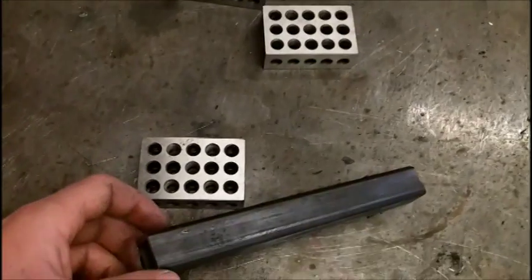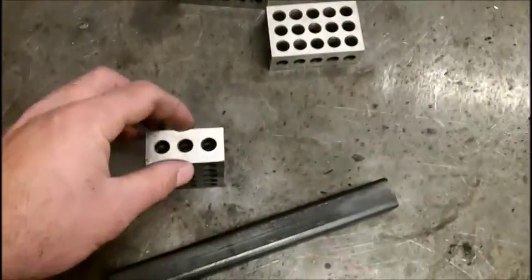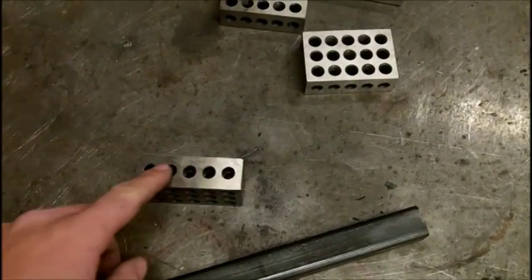I've been having some trouble with warping on the one-inch tubing. It's all 11 gauge, but with the one-inch I've been having more trouble than with the 1.5. What I've decided to try is getting some 1-2-3 blocks — machinist blocks — that are one inch in this direction, two inches in this direction, and three inches across.